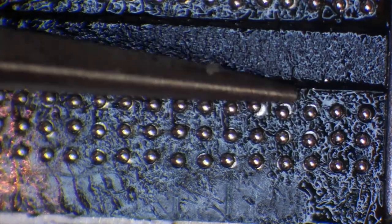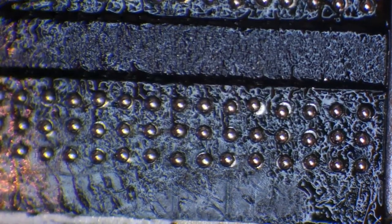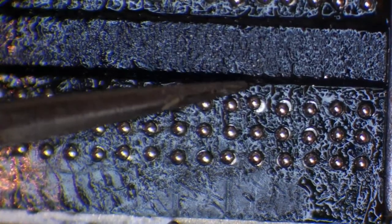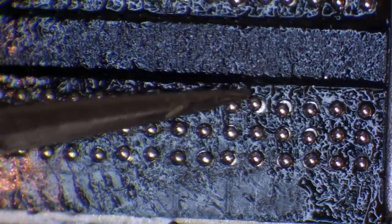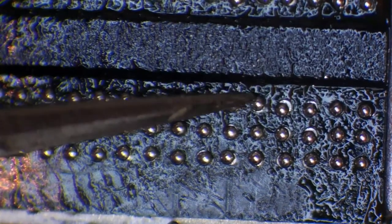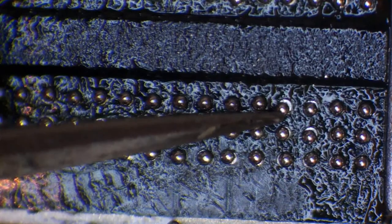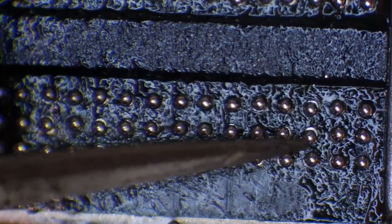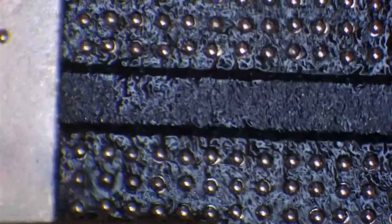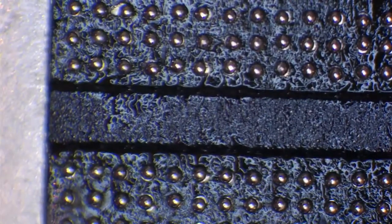So what you can do before you actually start this is you could put the chip inside an ultrasonic cleaner, you know, for just 180 seconds or 90 seconds or something, and just give it a little clean with ultrasonic if you have one. Now, you can buy a cheap ultrasonic for around about £20. They're not expensive, and they really do come in handy, especially for this kind of thing.